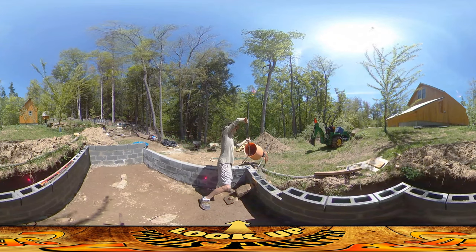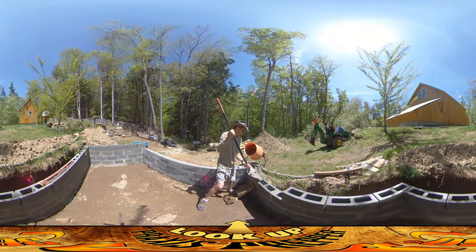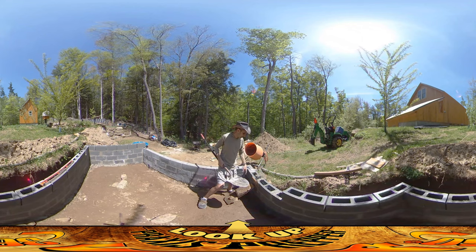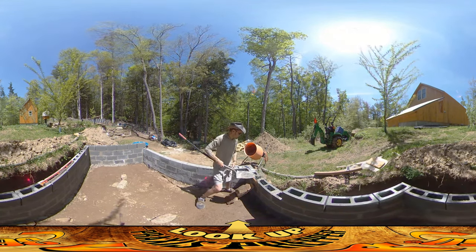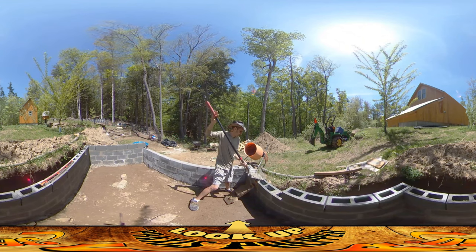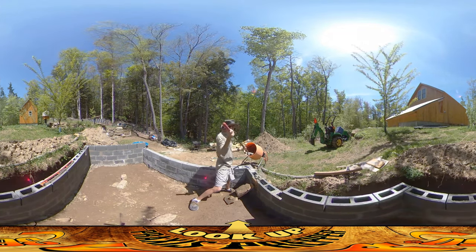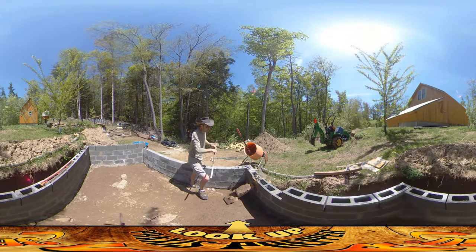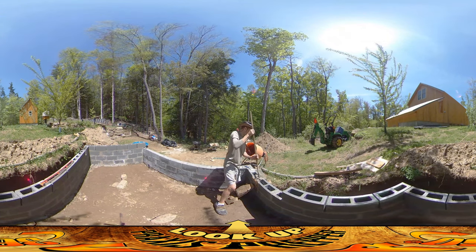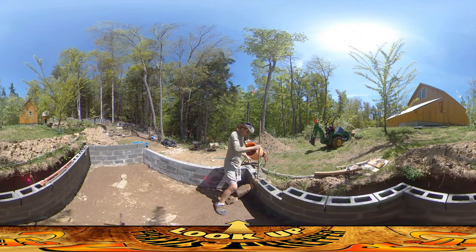So I'm going to pop some concrete right in here. I think I'll start with this little section here. Because of what I was mentioning yesterday about the six-inch wall giving you some issues with gaps here and there — I do have gaps as I go up — I'm just filling this one in. I've got a piece of plexiglass and a little piece of plastic with some plywood just holding it in place. I'm putting this stick down here to kind of agitate everything, get it dancing down into all the cracks and crevices.